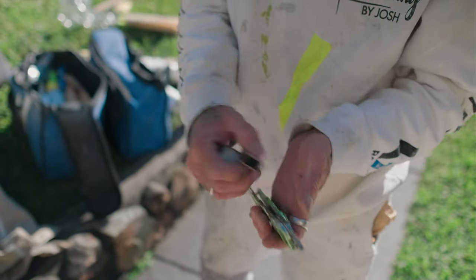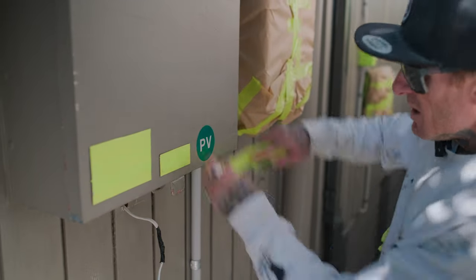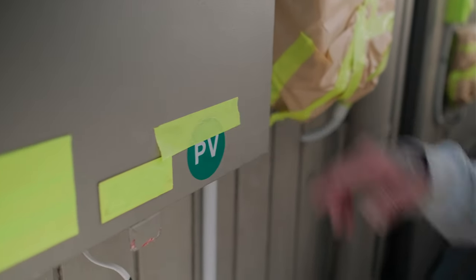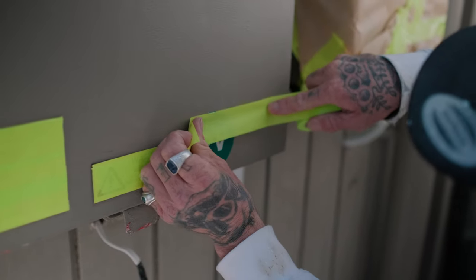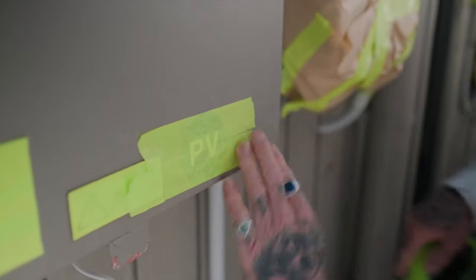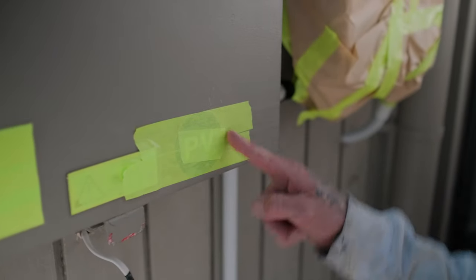They come in a nice little container to keep them in. A lot of time when you're taping up, if you tape it up here you've got all that area to cut. Whenever I'm doing anything like that, I always do it to that edge — it just eliminates a bit less cutting. Both edges top and bottom like that, fill in the middle, and that way you've only got to cut that side.